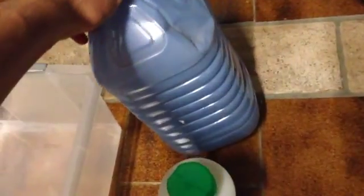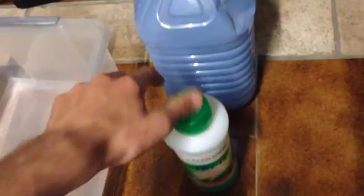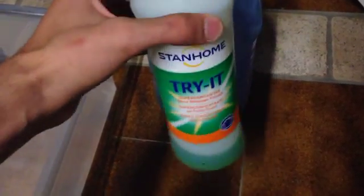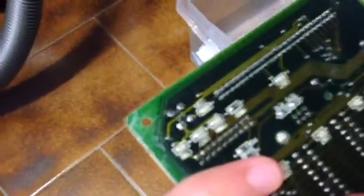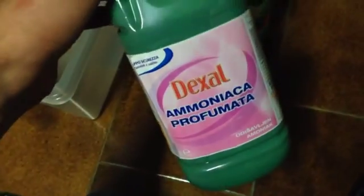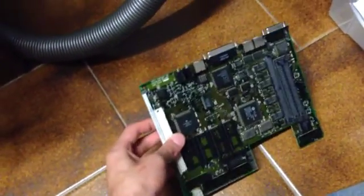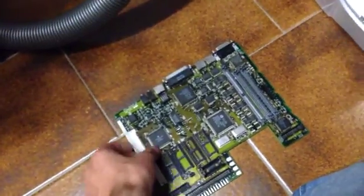Lately I've been using distilled or demineralized water. Plus I'm using this thing here - it's called Tri-It, it's essentially a degreaser - and that is just to clean the board from those residues and to make it shiny. Then I'm using ammonia - also bleach should work fine - for neutralizing the acid that those capacitors leave onto the board.